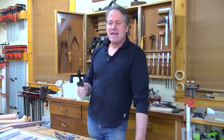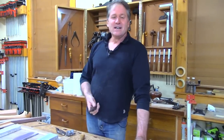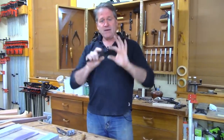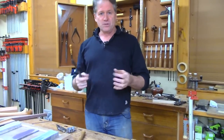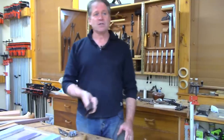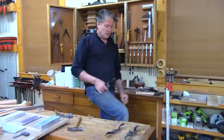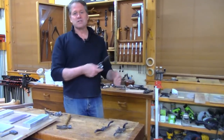Of making spoked wagon wheels and all that good stuff. You know, so the old wheels were wooden. And so you had the center shaft and then you had some heavy stout spokes going out to the rim. And quite often those spokes were rounded and the tenon shaped with spokeshaves. And often done on a special seat that held the piece in front of you and you could push out and lock it in place, called a shave horse.